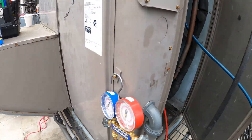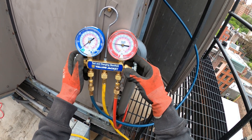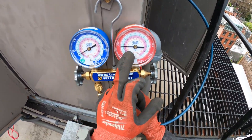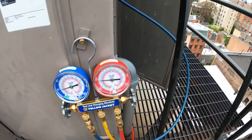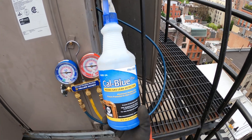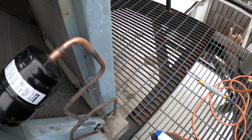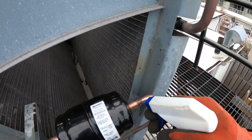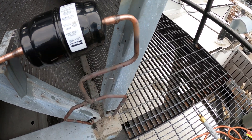I've got both gauges on this time. I'm going to charge through the high side and we're going to pressurize the system and check my connection. As I'm charging through the high side you can see the back pressure is raising. For leak detection I'm going to be using a micro gas leak detector, CalBlue+. We're fully covered but you always want to check your work. It's looking good.